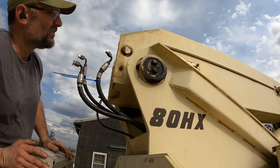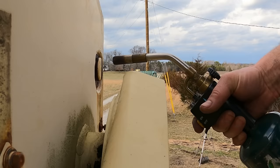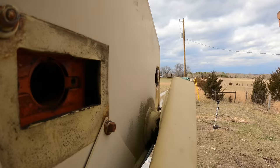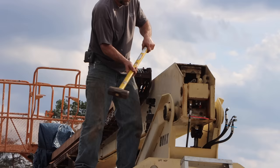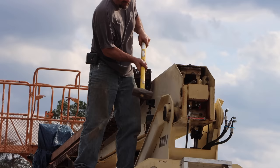Saying about cooperating? Nothing. So you'll notice there's a gap here and a smaller one there. Well, this is essentially the eye of the rod, and the pin is in there. And I want to know, is the pin seized in these outside areas? Or is it seized in this? I suspect it's more out here, because those were in the weather. This has been under that cover the whole time, so this probably didn't get wet. But they did not put a grease zerk on this pin because it really doesn't move.